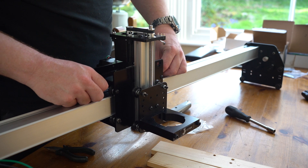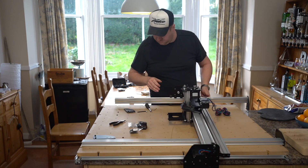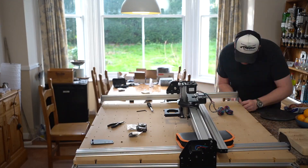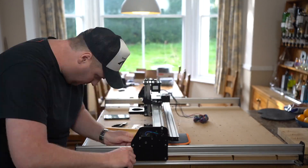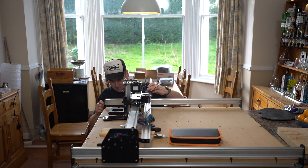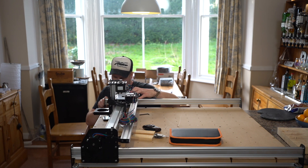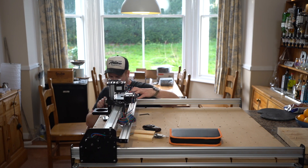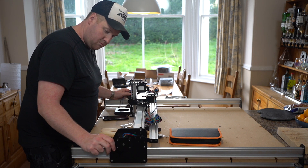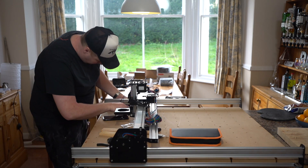Replacement wheels are available, but fitting new wheels will involve taking the machine apart. Once the rails and carriage were all attached and moving, I noticed one of the motors wasn't turning freely — it felt like it was seized or stuck. I dropped Ryan at 3D Tech a quick text and he replied five minutes later, advising me to check that the bare ends of the motor cables weren't touching. If the wires are touching each other, the motor circuitry is closed and it effectively becomes a generator when the motor is moved. I separated the frayed ends of the cables and the motor was free and moving again.